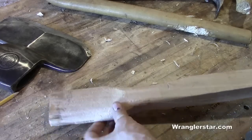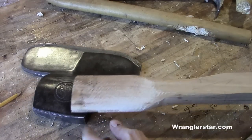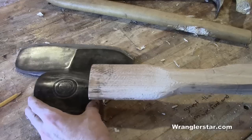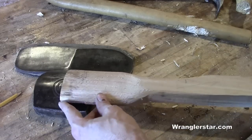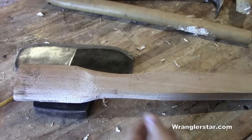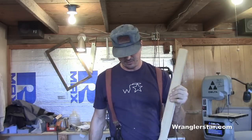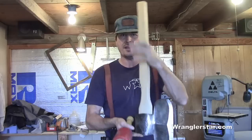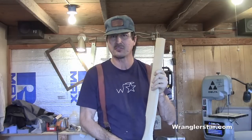I hope we got it right. I pounded this thing into the head just fitting it — maybe an inch or so — and it took me an hour getting it out; it just fits so tight. I went ahead and hopefully have everything done, because once I pound it on and get it to that halfway point, I don't think I can get it off. For anyone who's joined the channel lately: the mass of the head is so heavy that the forward motion of the handle hitting down will drive it into the head. It's the only way to properly seat an axe head.